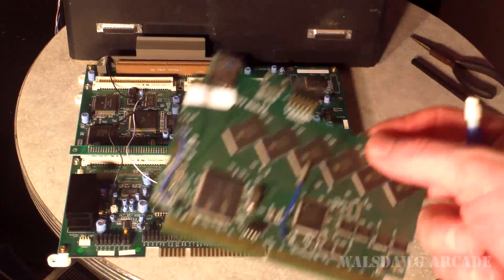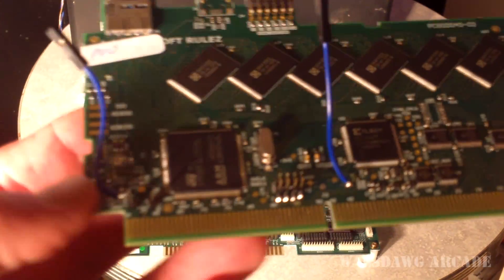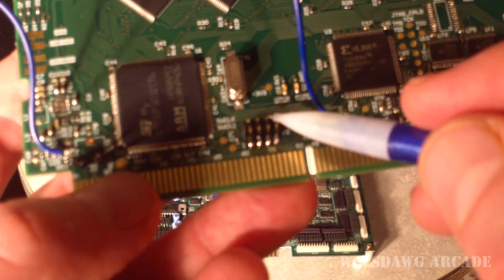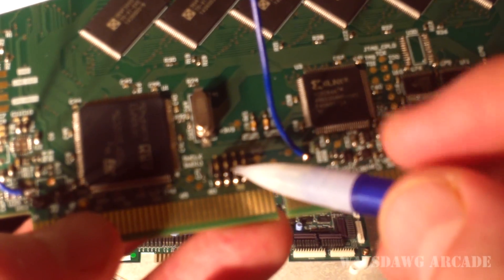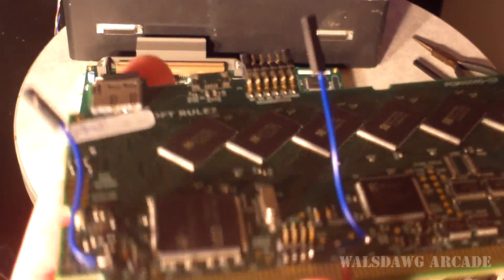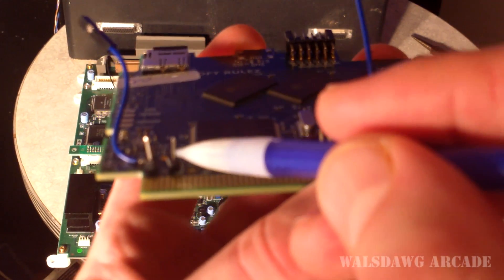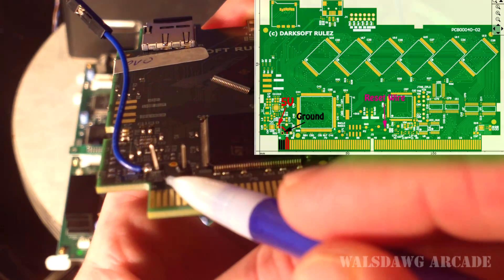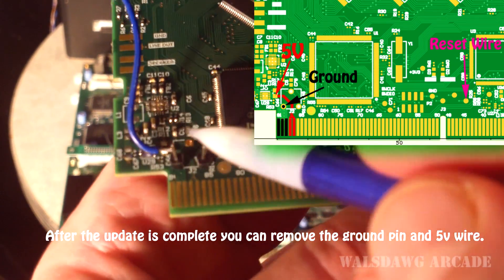As with the CPS2 multi-cart, you have to power the cartridge separately from the motherboard to update it. What you see here is your SWD connector, which you'll use with the discovery kit to update the ARM. This pin right here is the pin we use for the sound wire kit — it takes that hole there — but right next to it is a ground pin, so I soldered a pin there for ground.